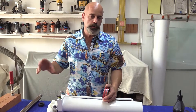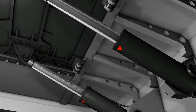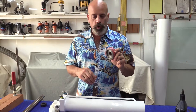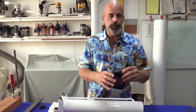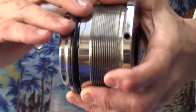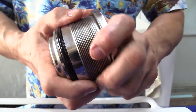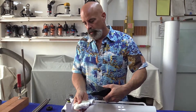When you see a hydraulic ram, you have all the assembly — it looks like it's very complex, but it's really not. You have a shaft inside, you have a cap, and you have a pressure flange. In order to assemble it, now that it's all painted up and cleaned up, I'm going to use hydraulic jack oil and coat all my rubber mating sections, O-rings, a little on the threads, make sure everything goes together really well, and put some on the shaft.